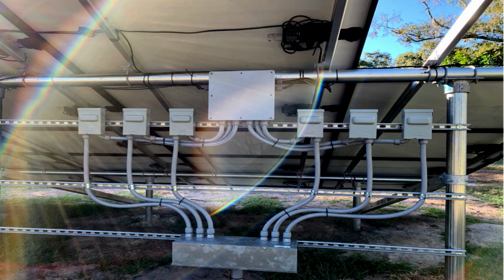And then on top of that, you see there's a little base plate set on there, and then you've got 3-inch galvanized tubes on top of that. That's again part of the substructure. Then farther away in this picture, you see some very short posts sticking out of the ground. Those are still 6 feet in the ground, and they're out of the ground maybe 1.5 to 2 feet, I'm guessing. I can't remember the exact on this one. And there's another row of 3-inch galvanized going the full length, and that's what these panels are mounted on. There's a lot of them on there.